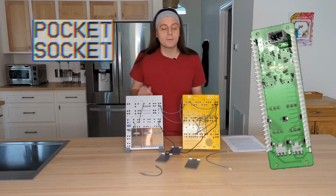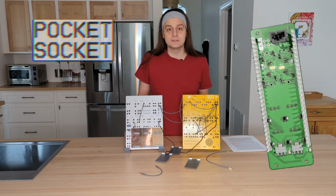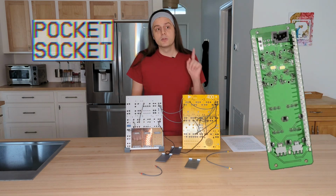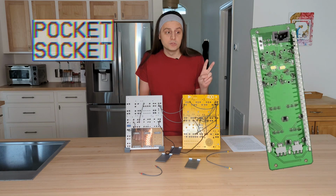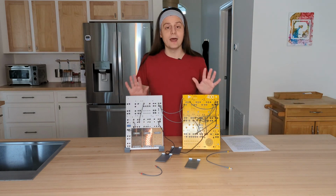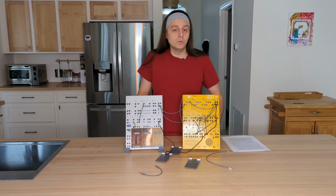It's got these pins in the back where you can click on another board. I haven't made any of those daughter boards yet, but it's a good basis to do so. Also, there is a 3.3 volt and a 5 volt regulator on the back. So if you're gonna have like a microcontroller in the back, you got the power situation all sorted out already. It's cool.